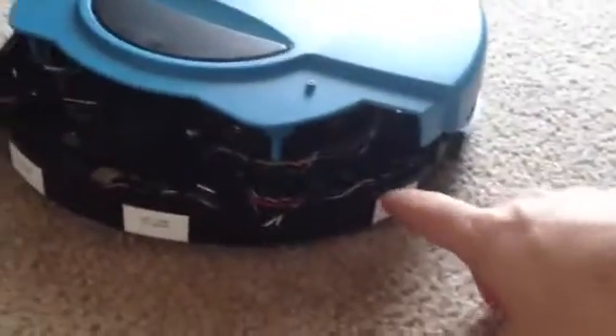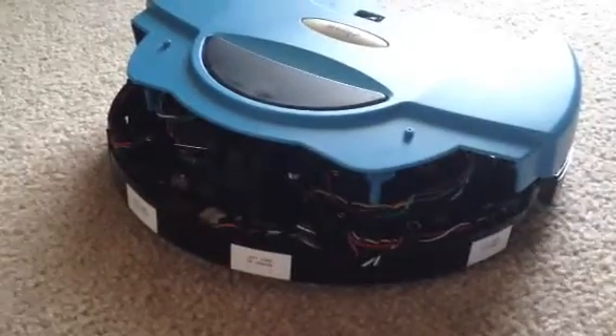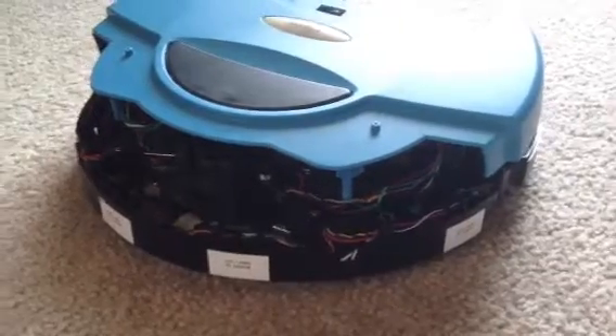In reality, I'm having a problem with this sensor, and I have to pull out a resistor pack and put in a bunch of variables so that I can go through and individually tune these through the comparators. And I'm not sure that this will work great on the carpet — I've only been practicing on a white tabletop, so we'll see.